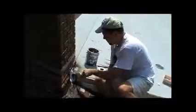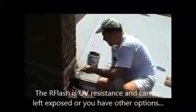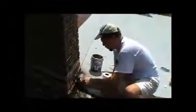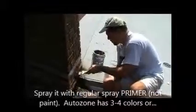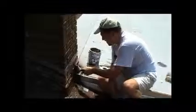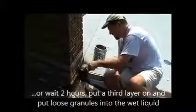So I've done this little leg right there where the transition in the roof is, and I'm flashing that. So I've done liquid reinforcement and painted on the liquid again at the lowest point, and then I painted on some more liquid, embedded more polyester, painted more liquid on this little leg that's going on, and now I'm painting and preparing to do the highest point of the bottom side of the chimney here.